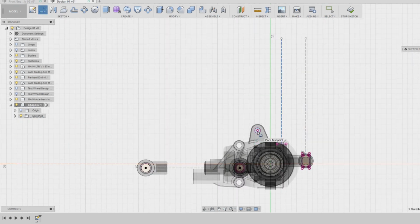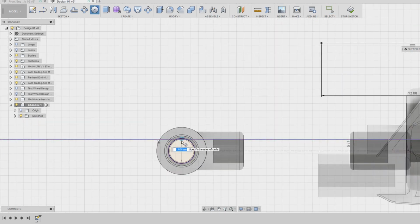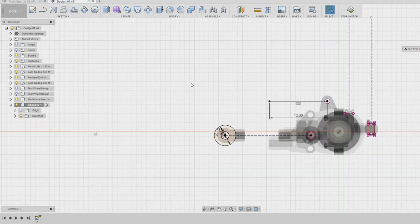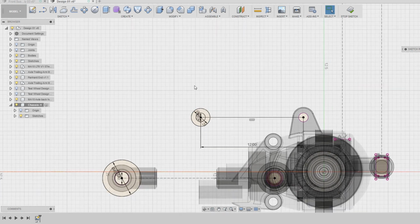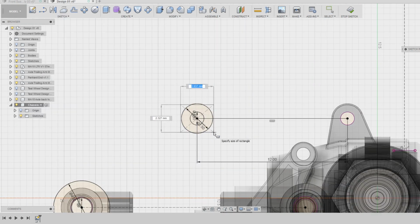Within Fusion 360, I imported all of the components that I will be building this chassis around, such as the MA10 axle and relevant suspension links. This chassis will allow for both a torque arm suspension setup like what I'm using on the Firebird, as well as a 3-link suspension to be used as well. At some point, I'd also like to design some similar chassis that allow for more kinds of rear suspension setups.